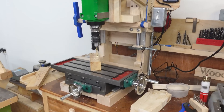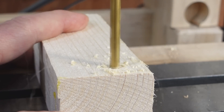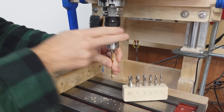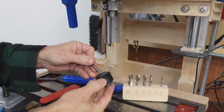I like to use this machine with its x-y table and digital readout to drill holes accurately in wood. But entering the wood, the drill often drifts to the side a little bit. I can counter that with stiffness by using a much shorter drill bit and by getting rid of the drill chuck altogether, just using a collet.